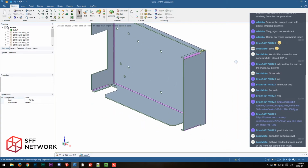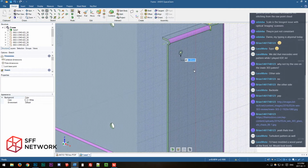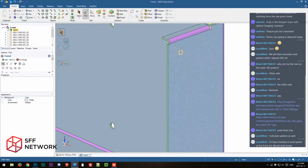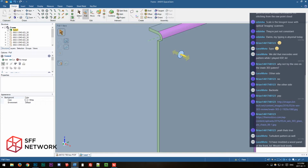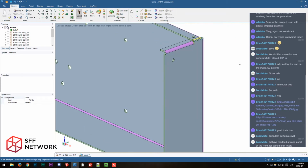All right, let's open up the frame piece. So I'll need to put 4 threaded holes on the front, so that you can screw on your accent panel, like wood or acrylic. Yeah, that'd really be most of it, I guess. Anything else would probably be too expensive to do. So that'd be 4.22, and the 4.22 number comes from the hole size for the PEM nut.